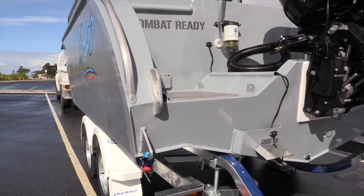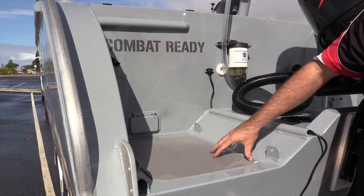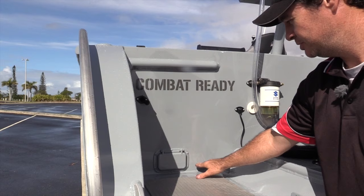It's got to handle the weight of all that on one side in particular. You'll notice here too it's got a deck pad and also some lifting lugs — tie-down lugs for the customer to strap to, who does a lot of diving up there as well. A full transom of 600 mil to the false transom, and it also has a 25 mil step up to the floor there so that the scuppers are really at floor height, so everything drains out nicely.